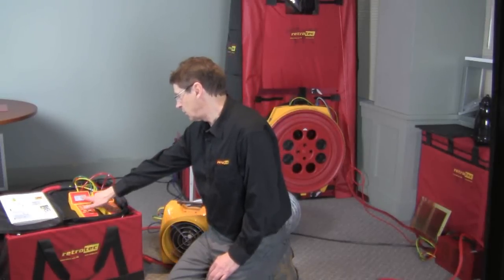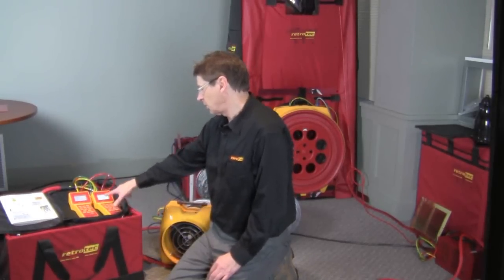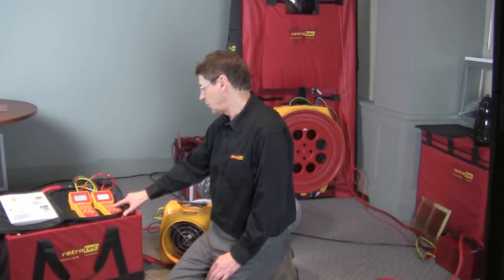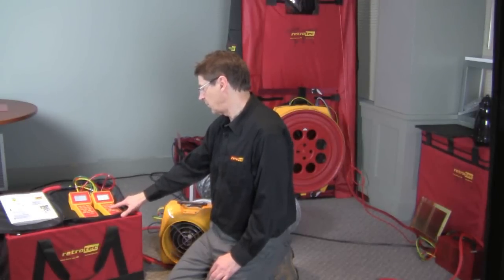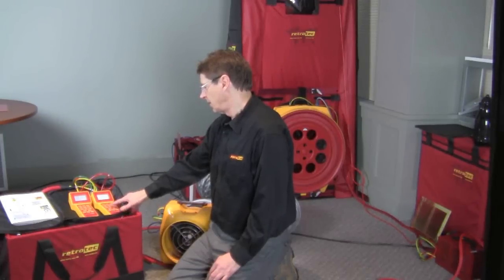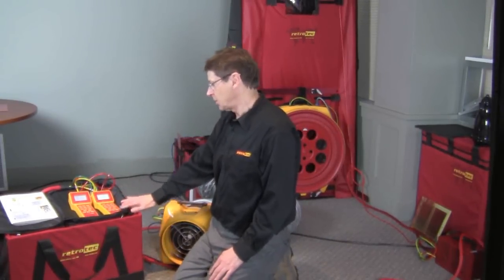Now these two pressures are not exactly evened up, so we're going to drop this one down a little bit by hitting jog, just dropping that down a little tiny bit, so that the pressure here is almost the same as the pressure over there. There we go, we're at 25 pascals. The flow rate that's leaking out of the ducts right now is all leakage to outdoors. The indoor leakage has been neutralized, and it's dropped from 160 down to only 60 CFM. So that's been the result.